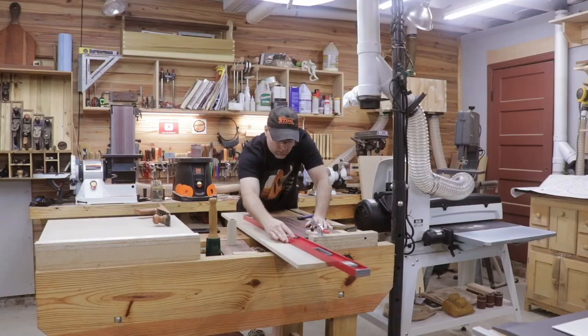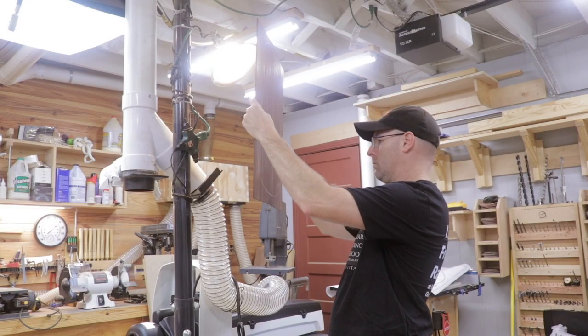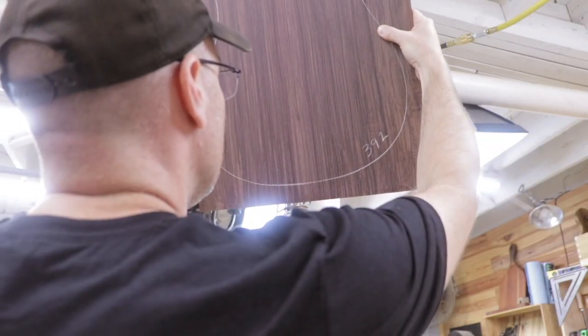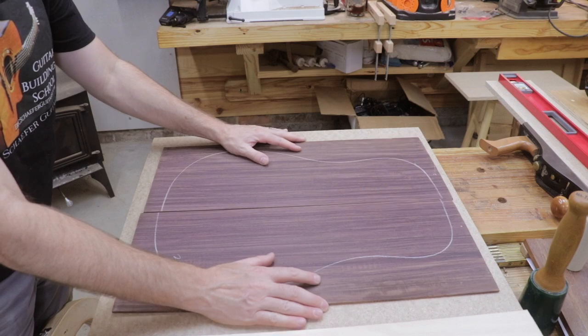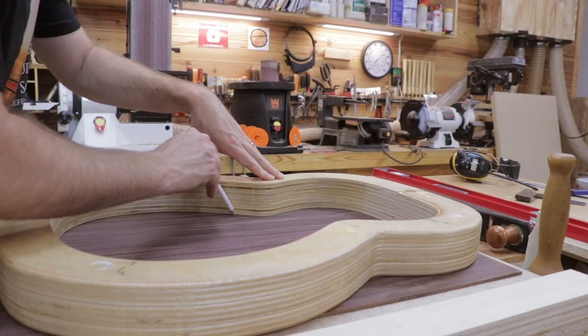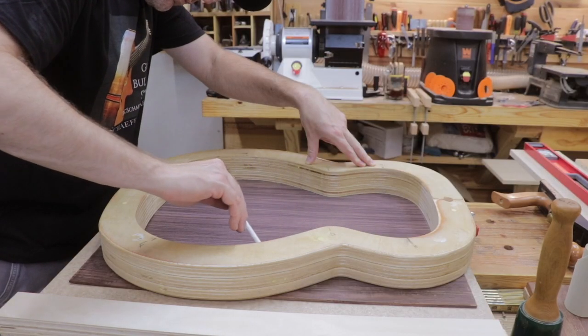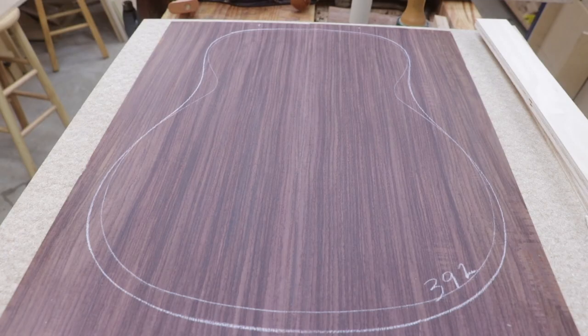Once the joint was close, I would hold the joint up to a light to assure no light was passing through the joint. To fine tune the joint, I used 220 grit sandpaper adhered to my 3-foot level. This was an easy way to perfect the glue joint. Before gluing the pieces together, I used the guitar mold to mark out the layout of the guitar back. This allowed me to pick the area of the back with the most interesting grain pattern.